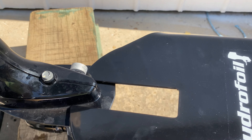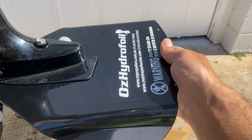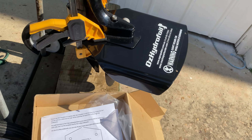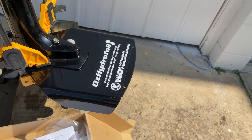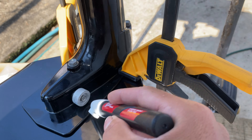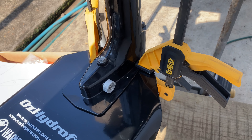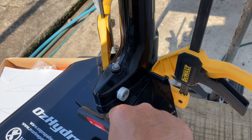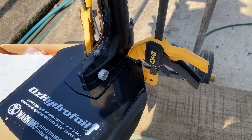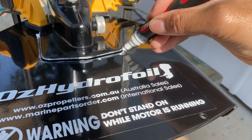So we have this template here that they sent me — pretty much useless and it's not for this size outboard. They could have just sent me toilet paper really. This one doesn't go on top of the cavitation plate; it goes underneath because it hits the sacrificial anode just here. So it goes underneath like this. Go find some clamps and get it situated. I've just eyeballed it in — I'm just going to run the old texta around and then I'll bank some holes in this top plate and it should all work out hopefully.